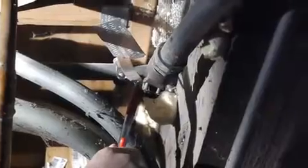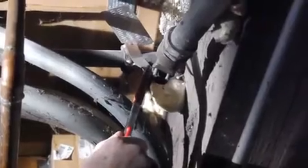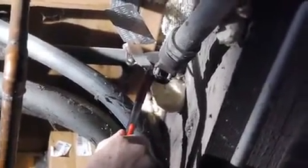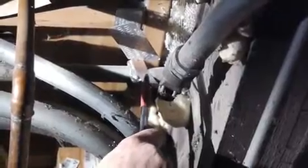If you don't have one of these in your building, or if you don't have a driven electrical ground at the building's exterior, you'll see that in a minute, you're going to have a major electrical problem. So take the 20 minutes to examine your own home and look for this bonding strap, this tag, and the wire that's next to it that illustrates that the equipment is properly grounded.